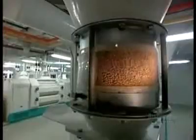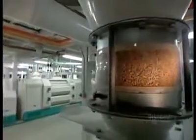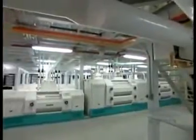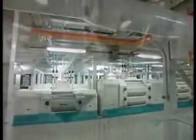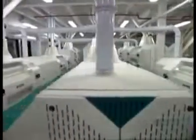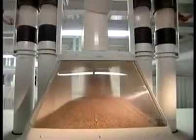This mill's vertical production line is five stories high. Gravity carries the wheat downward through a succession of milling machines. Each one grinds the grain between steel rollers, then sifts it. Particles too large to pass through a sieve continue downward into the next milling machine, and so on. By the last machine, whatever's still not fully processed gets vacuumed up to the top to begin the cycle again.